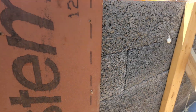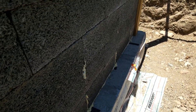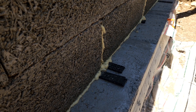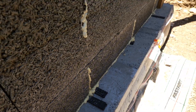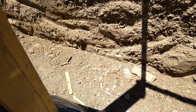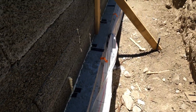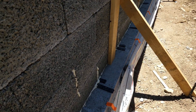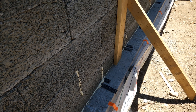Down at the bottom on the first course, we got perfectly flat. Using my Topcon laser level, we shimmed every single block essentially to get up to the height of the highest block, and got it pretty much perfectly flat within probably a 16th or so across the whole surface. Then, instead of doing mortar like they describe, I talked to the fastwall rep and he said it would be fine to use Great Stuff expanding adhesive. Everything seems to have stayed pretty flat.